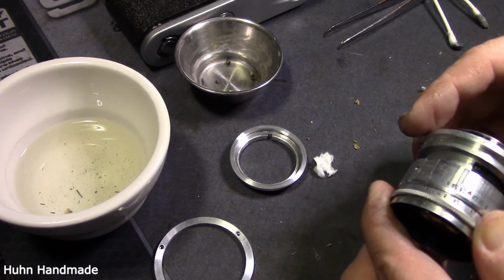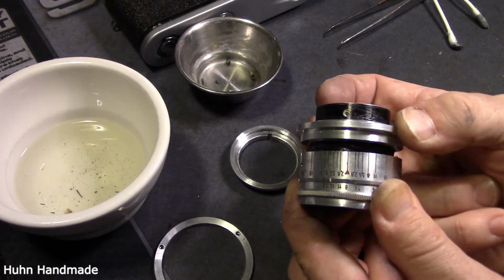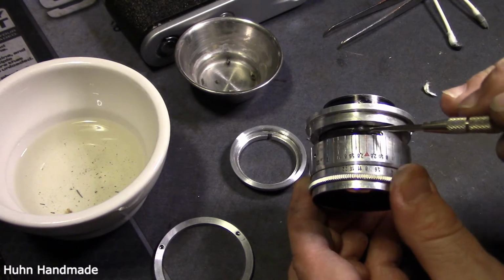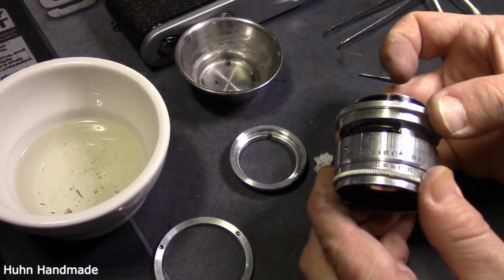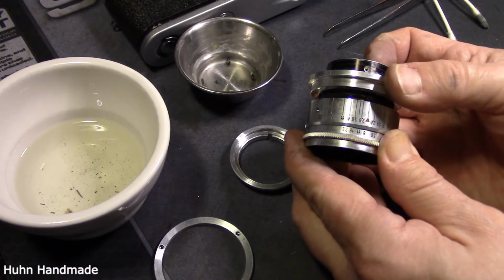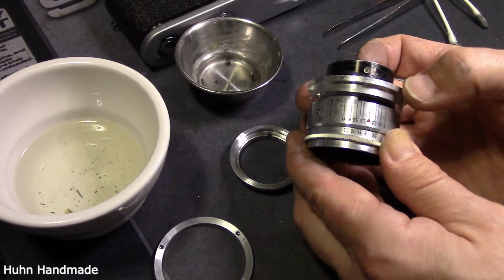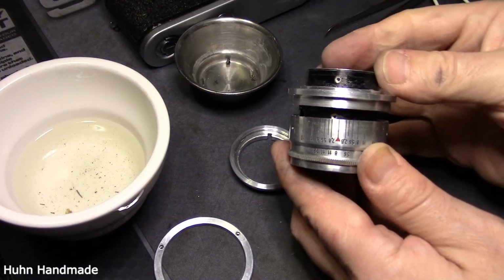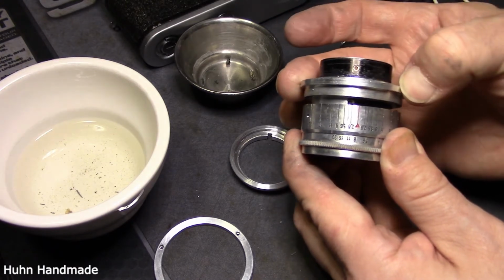So when you go to put this on, essentially what you need to do is line it up, and it's just trial and error. If you haven't marked it, here I'm just making sure where I'm going to put that screw. Well, here's where I have to remove the grease, but where you put the two screws there, you have to position it such that at minimum focus, the top screw is coming up against the rear flange on the focus ring. And then at maximum focus, when you turn it all the way back around, the lower screw comes right at the edge there of that little milled out area on the focus ring and keeps it from rotating further than infinity. And that screw goes right there. The two are directly in line on the axis of the lens, and that's where it should stop, right there. So that's where you need to put your screw.